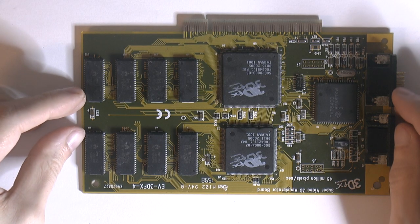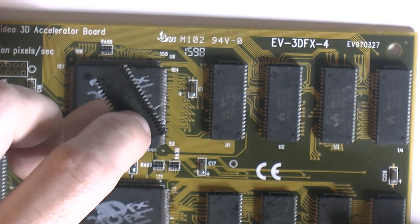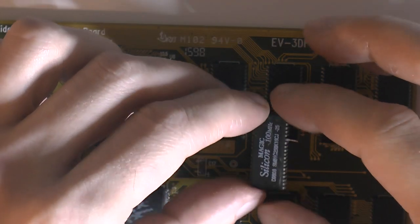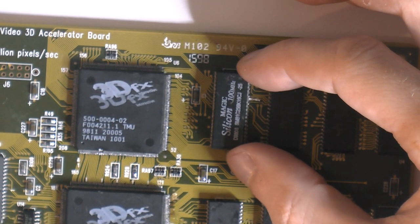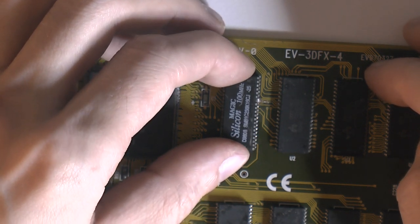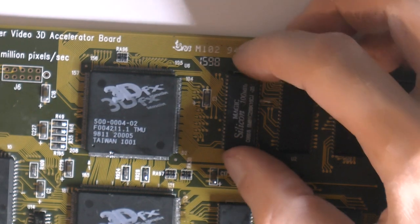So now that we have a working Voodoo 1, I want to upgrade it. So I have some RAM here prepared. I have this chip here, it's prepared. It has straight legs and one pin sticking out, and that's pin 14, because that's the RAS, and that needs to be separate. So we gotta piggyback these chips onto here. And then you create a new line for the RAS from the FBI. So this is a texture RAM upgrade. It's gonna give us 4 instead of 2. So it will just fit straight on like so, and then we have to solder it.